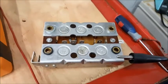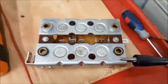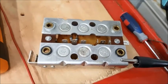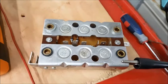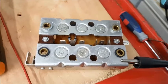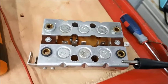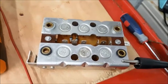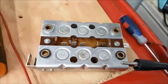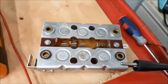This is my diode board out of my BMW R100 CS 1984 model. I was having a problem on the bike with it not charging up to between 13.5 and 14.2 volts. Sometimes it would get just a little bit over 12, and then when it was idling, the battery voltage would drop down to about 8 or so. So it didn't look like it was working right.